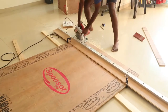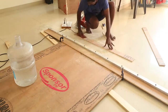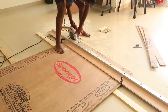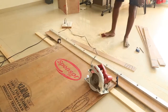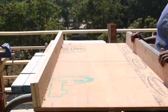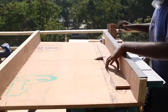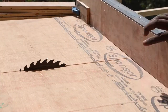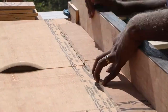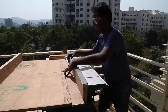I measure and begin cutting with a circular saw. The cut pieces have rough edges so I sand them with a sanding block. To cut the pieces to length I use my crosscut sled. I set a stop block on one end and then push each piece up to it and begin cutting. For the shorter pieces I measure and change the stop block's distance, then cut the rest.